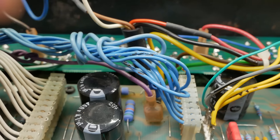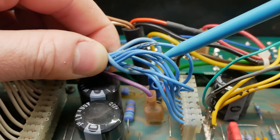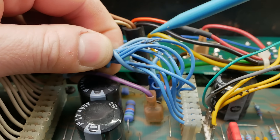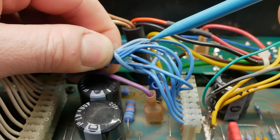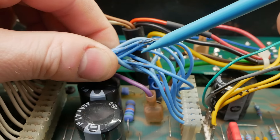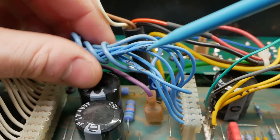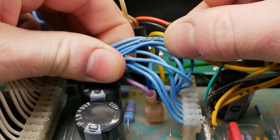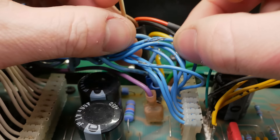There are burns and melts in the wiring everywhere. Looking at this pattern, there may have been a short from wire to wire — you can almost make out the individual strands of whatever melted this, like another hot wire. I wonder if at one point there was some heater wire wrapped around this cable going to the header. That looks like maybe at some point there was a heater short or an HT-to-heater short. It looks like there have been a few traumatic events in this amplifier's life — it's our job to let it have an easy life now.